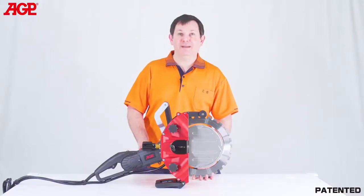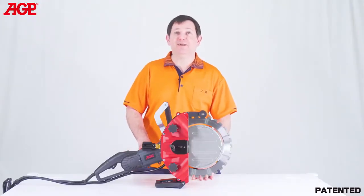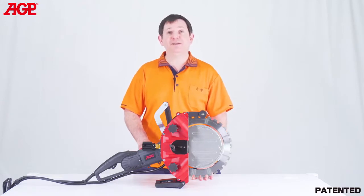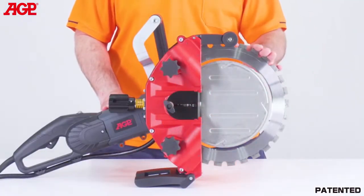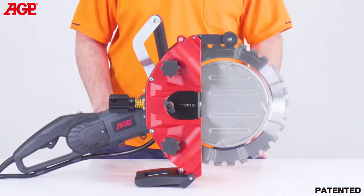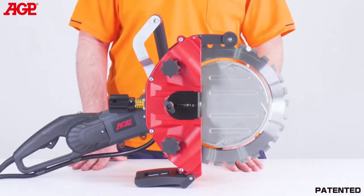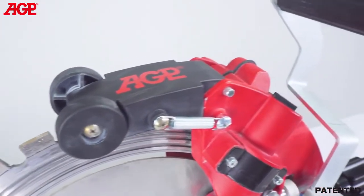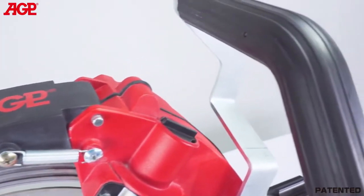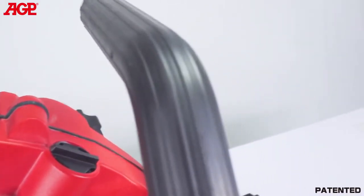This is the R13 Ring Saw. It's specifically designed for extra deep cutting of reinforced concrete, masonry, and stone. It uses a 13-inch or 330mm ring saw blade to achieve up to 9-inch or 220mm depth of cut. To achieve that depth of cut with a conventional circular blade, you would need about a 22-inch or 560mm diameter